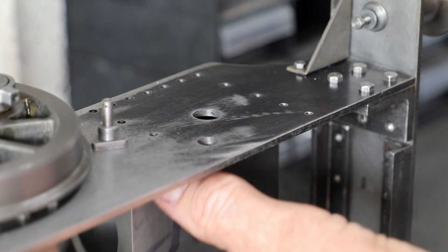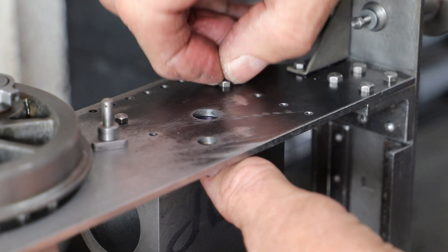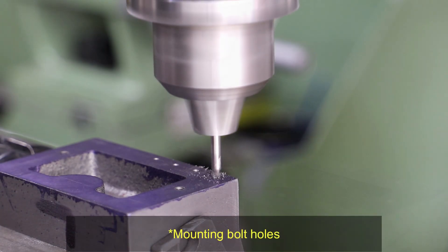Because I'm a cautious man, I now fit the cylinder block in place using those two tapped holes and again do a visual check on the others. As it all looks good, I crack on and drill and tap the remaining holes on this face.